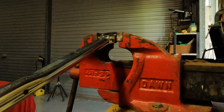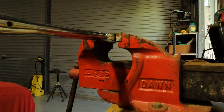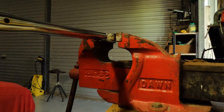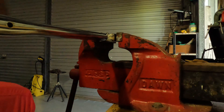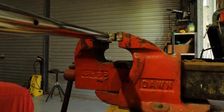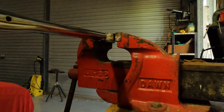Let's give it the old normal direction — pull it here — click, that's the normal torque, it's reached its torque. Now if we go the other way, it doesn't click. So this is a forward-only torque wrench, and I was using it in reverse.